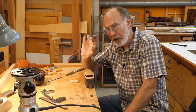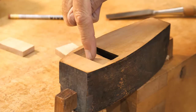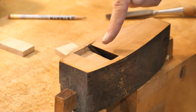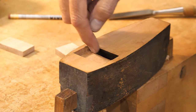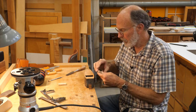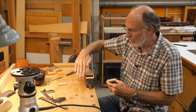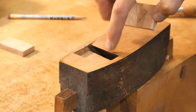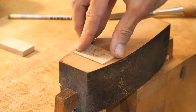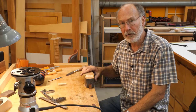Here's the first one I cut, which I realized once I got it in there is too short because of how the mouth is on this plane. This surface on the front side of the blade — above the blade — is called the wear. There's a website I'll link to that talks about this. On a Krenov plane that surface goes in that direction so I wasn't worried about the length, but if I want to make sure I cover all that, this needs to be longer. So I've got this fitting nicely and I'll go ahead and glue it in and let it dry overnight.